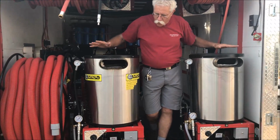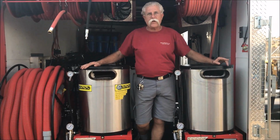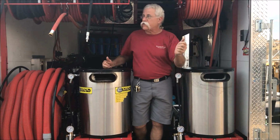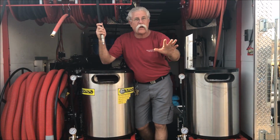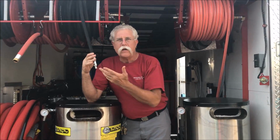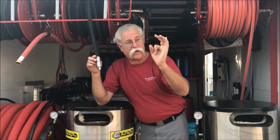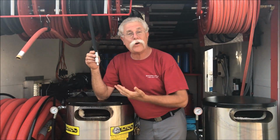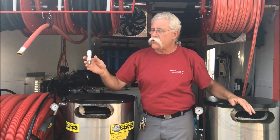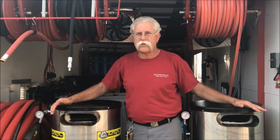All right? When you're running long hoses, you've got pressure drop. It's even good to do the testing on your system at the trigger gun with another gauge once in a while, so you know whether you've got a flow restriction. When we sell really good quality hoses, we take them for granted, right? So you hook up to a hose that's 2-3 years old, you're not thinking about that steel fitting rusting away, and that hole inside there that was pretty small to begin with is getting smaller and smaller. Maybe your hose ends themselves have become flow restrictors. It needs to be checked once in a while. If you need to drill them out just to get rid of the rust so you can use that hose for another 6 months or a year, whatever.